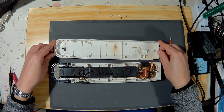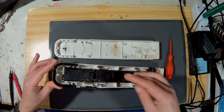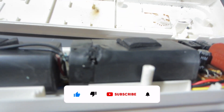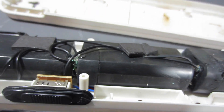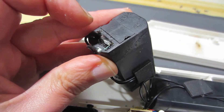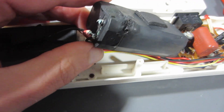It doesn't bode well. I immediately notice a very dangerous thing: there is no transformer — mains voltage is present on the circuit. There are three 4-volt lead batteries placed in parallel; one of these seems to have exploded and has left a burn mark on the body. The others don't seem to be damaged but have the wires detached from corrosion, perhaps that's why they didn't explode.